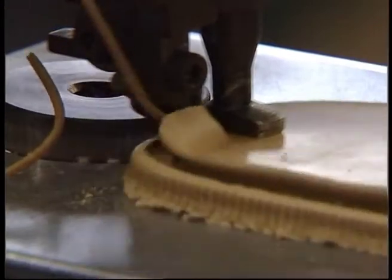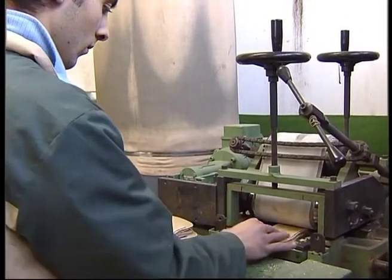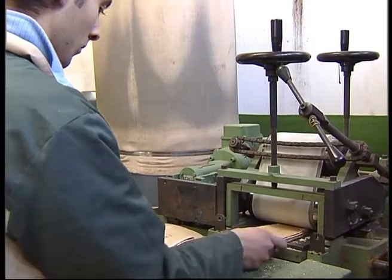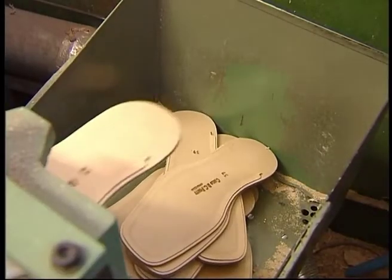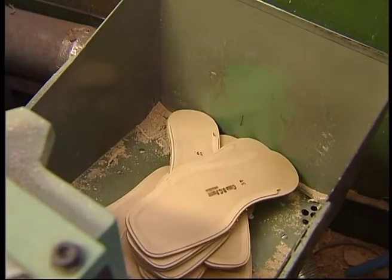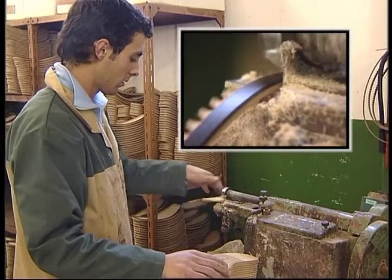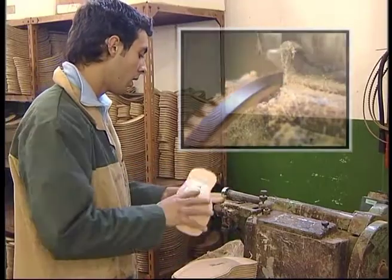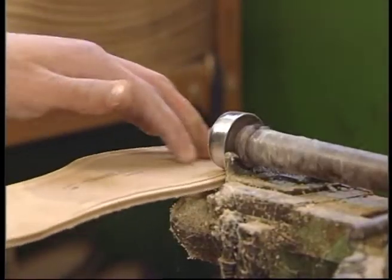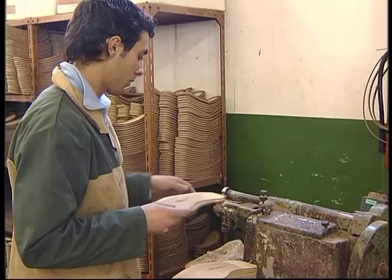In the case of soles in which the channel is opened, the seam stays visible in the sole. Sole splitting: the leather is a natural material that presents different thickness, making standardization necessary. With the purpose of standardizing the thickness, the sole is placed in the splitting machine which removes the material in excess and prepares the soles to allow better sticking. To apply glue to the welt and sole: before proceeding to the application of the welt to the sole it is necessary to apply glue to the welt and the footmark. The glue is applied in the outline of the footmark for subsequent sticking of the welt. The operation is executed with a cementing machine with spreading roller but could also be executed manually.